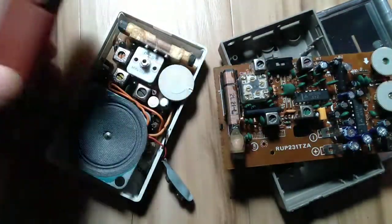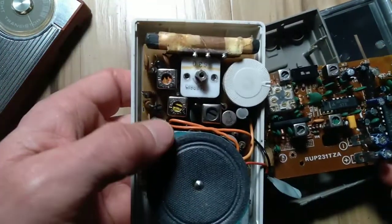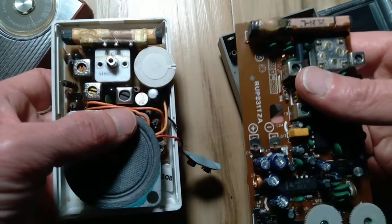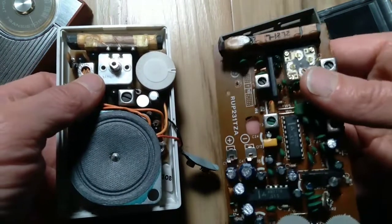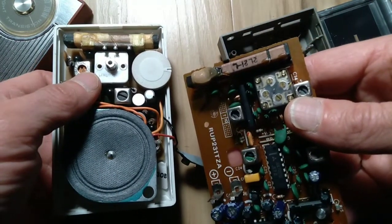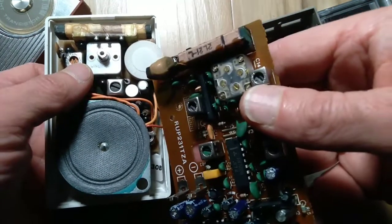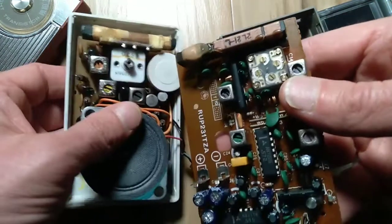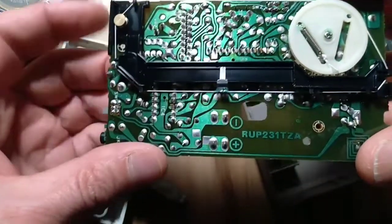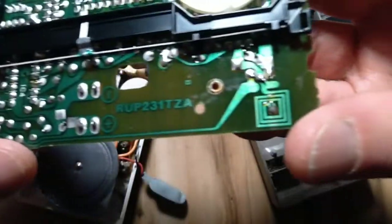This thing can blast out volume with an external speaker hooked up to the headphone jack. I'm having some trouble with the reed speaker. This is an AM radio. Coming back to it for a second, you can see how much simpler it is. I think maybe that one is an FM coil — this one here is labeled L5 as an inductor, so I'm guessing that's an oscillator coil adjacent to the variable capacitor tuning mechanism. Very smooth — this radio is actually in pretty good shape.